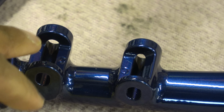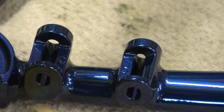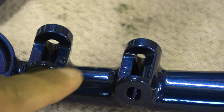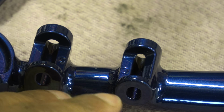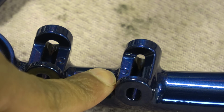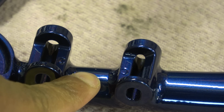These are the brake mounts from the bottom. This is very, very tricky to do because you've got a thin section and fairly elaborate shape. So you need to make sure that all of this stuff stays in one place as you apply it. Whoever's done it has probably preheated this to stop it blowing out or to probably stop it going brittle.